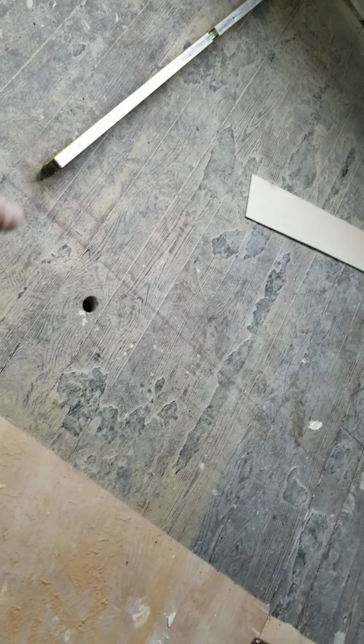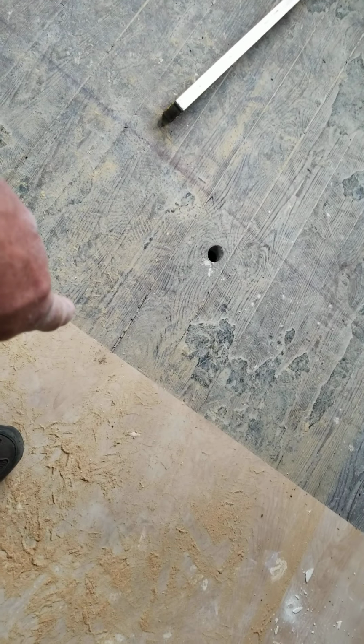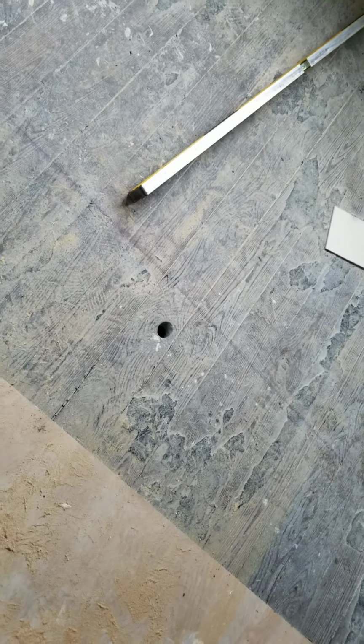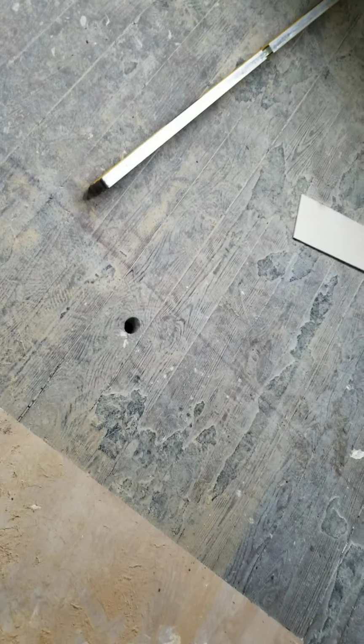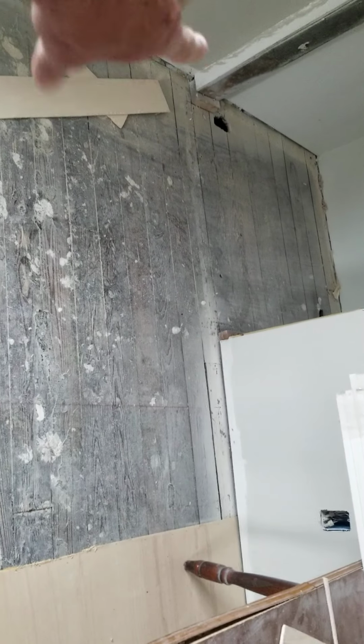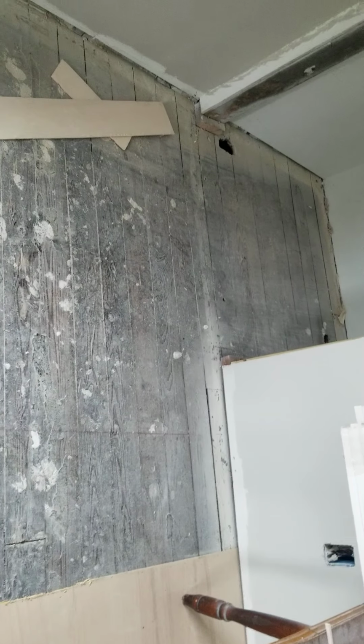We're going to pour floor leveler from the underlayment. We'll clean this up. Floor leveler from the underlayment to the 3/4 inch. We're not going to put any underlayment up on this section here. We'll end up just running maybe another 2x6 or whatever on the floor there to create a base. Don't even worry about it.